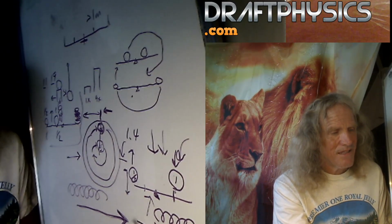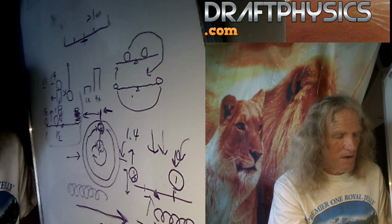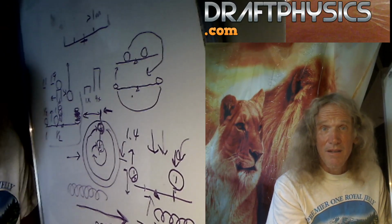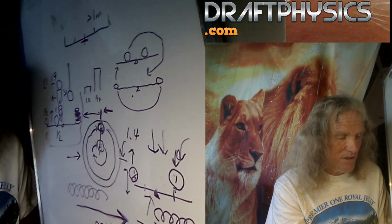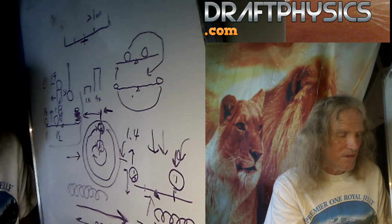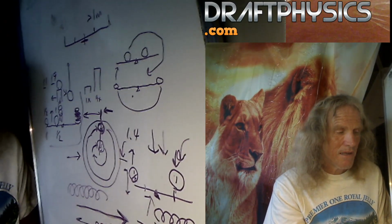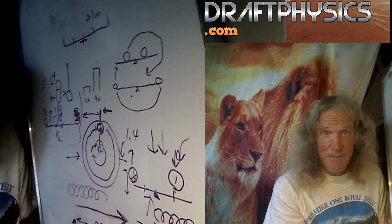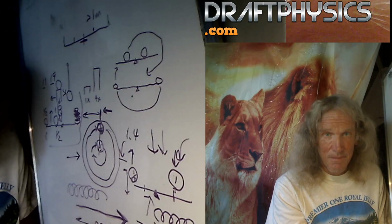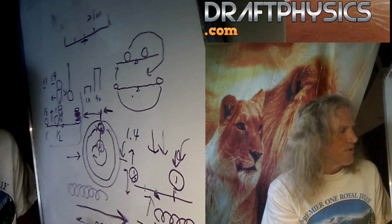And obviously there is a maximum speed at which the spring can expand. So as I put lighter and lighter things on the spring, there's a point where the spring can't go as fast as it needs to go to push the object as fast as you want it to go. I can put something ultra light on the spring, and it won't get any useful energy out of the spring, because it's not capable of being pushed fast enough to take more momentum out of the spring. So those are real limitations.